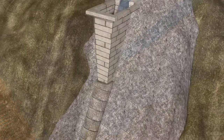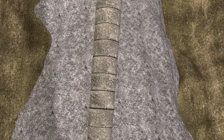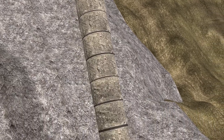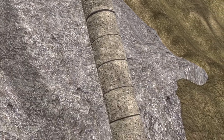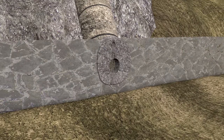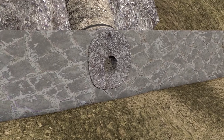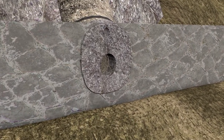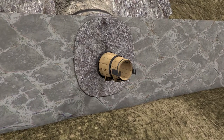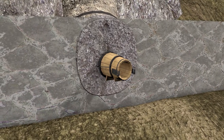The lower part of the chute, made of chiseled and fitted cylindrical stones, had a gradient of around 30 degrees from the vertical axis. The chute ended with a large stone, the siphon stone, which was set into the wall of the space accommodating the moving parts of the mechanism. This large stone had a chiseled opening in its center, the siphon. At this opening, they fitted a wooden spout reinforced with metal bands so it could withstand water pressure. Its incline was adjusted with wooden props.